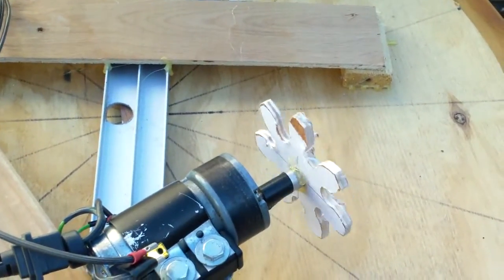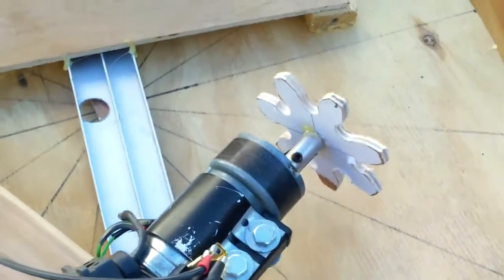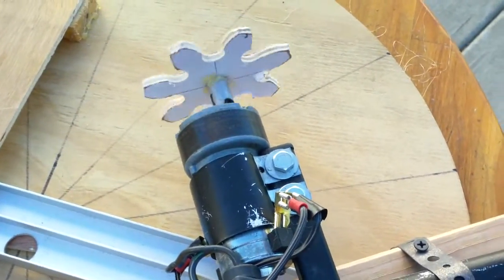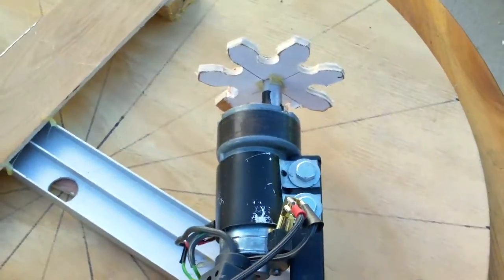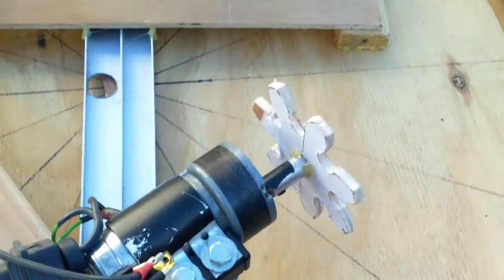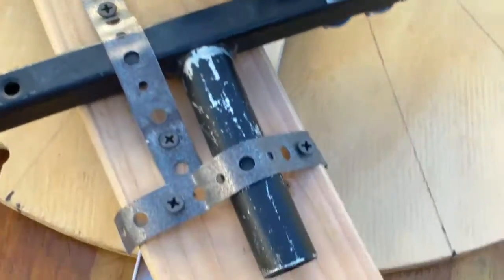If I move it to one side, the motor goes counterclockwise. Move it to the middle position and the motor stops. Then the motor reverses — now it's moving clockwise. So there's a range where it will not move. You can imagine the sun moving over here and then your tracker will move. When one panel gets more sun, it will move — that's how it works.